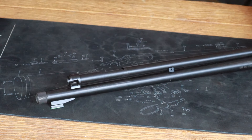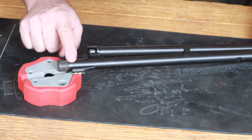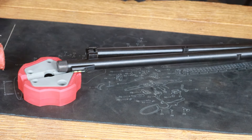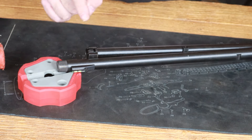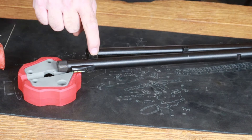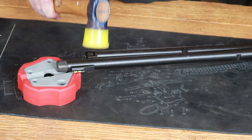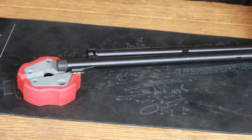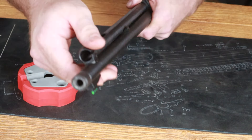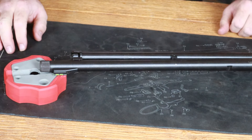Get this lined up in the groove — the factory tenon slides just a little bit and allows you to line everything up. Make sure everything's nice and level before driving it back home. Use your bench block and non-marring hammer and very tentatively tap right here. I don't want to hit way out on the end or you'll twist the whole thing. Just tap until it starts going into the dovetail, and it'll fall right into place. Then go ahead and get your handguard.